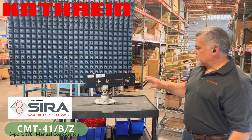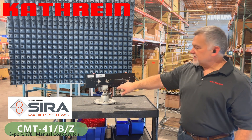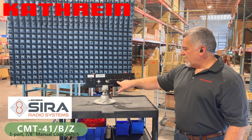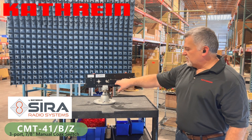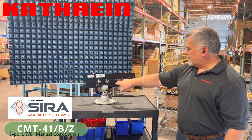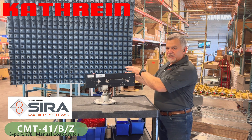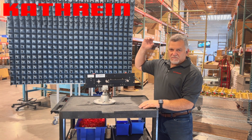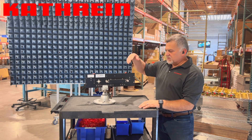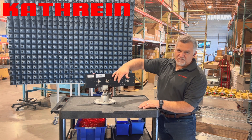This is a really nice switch with really nice U-links. With this U-link and with our larger U-links, we have an option where we have a test port in the U-link. If you remove this U-link, you can have a 50-ohm N-female test port here that allows you to look into any one of these ports without having to break over any of the plumbing. If you want to look at the upper half or lower half of the antenna, you're not going to have to pull the input off and sweep through the switch or the system — you're going to be able to do it right from the front panel, right from your U-link.